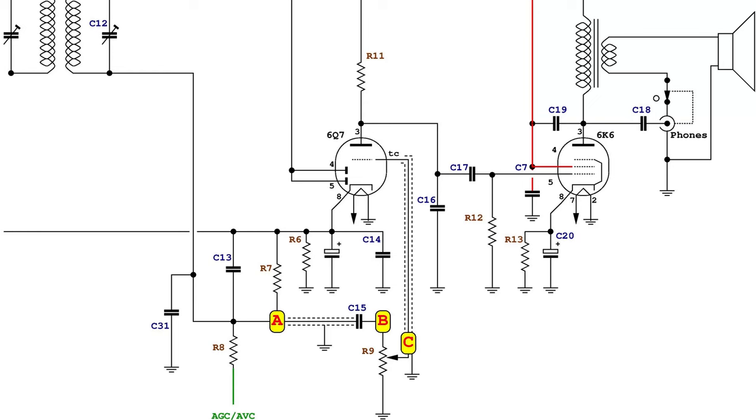Also disconnecting the capacitor C15 from the point A and connecting it to ground instead. The audible hum remained loud. Also removing the final amplifier tube, the hum at position C remained visible with the oscilloscope. After more unsuccessful investigation, including the replacement of the shielded connection from C15 to the grid of the preamplifier tube, it was guessed that the culprit could have been the preamplifier tube itself.